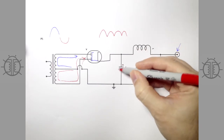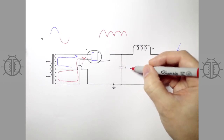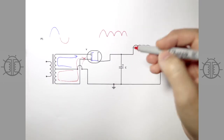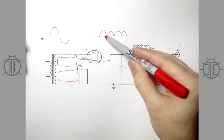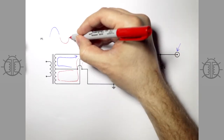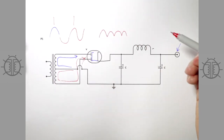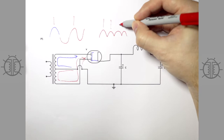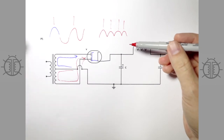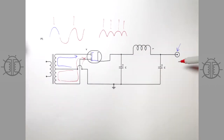The first thing you do is put a cap to ground here. Capacitors act like dead shorts to AC signals, and it'll be sized to short the 120 Hz ripple coming in. The reason it's 120 Hz is because you had 60 Hz before rectification, but now you've got full-wave, so it's 120 Hz. That's actually easier to filter out because it's a higher frequency, although 120 Hz is also more objectionable if it comes through than 60 Hz usually.